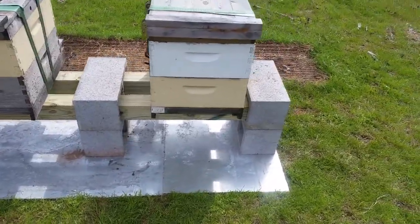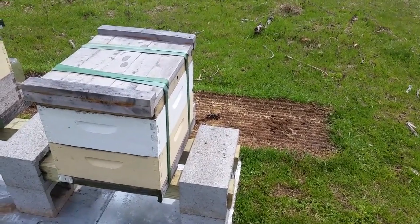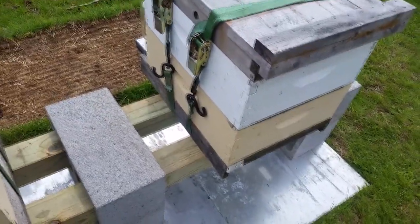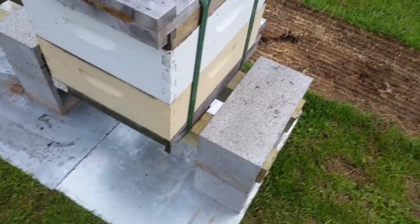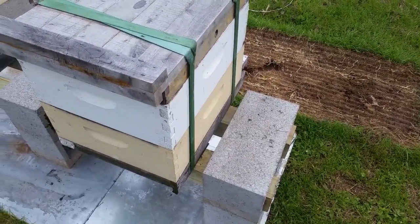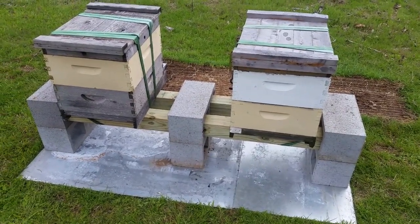The straps — I didn't run them through the cinder blocks this time. I didn't want that much strap exposed at an angle out in the air; it'd be easier for something to hit it and break the boxes loose. So I went around the boxes themselves but crossed the straps over the 4x4s — on this side it goes to the inside of the 4x4s, and on this side to the outside, so the strap wraps around underneath. I tightened them up and really pushed and kicked around on them, and they're not moving anywhere.